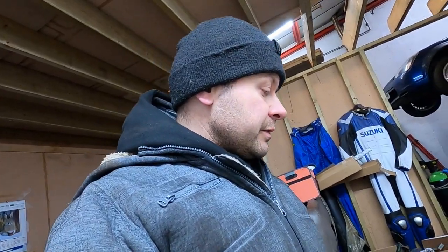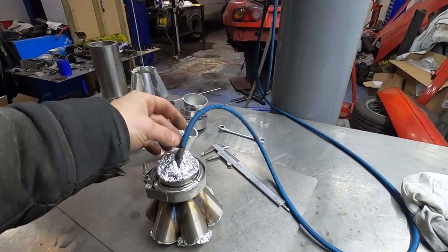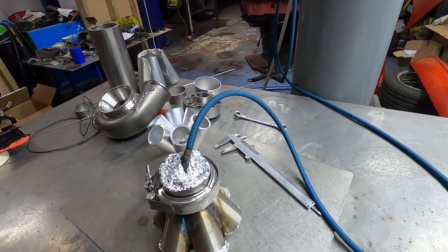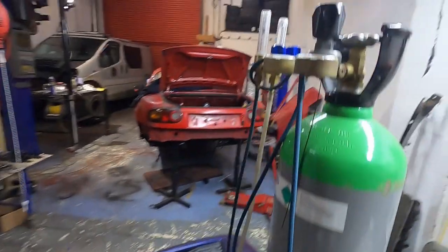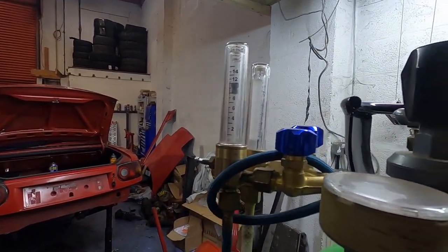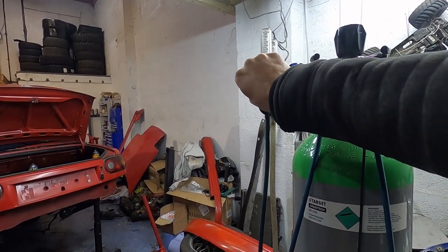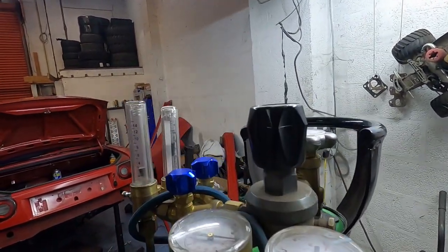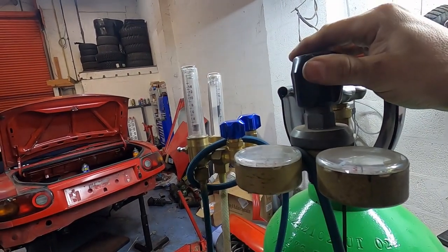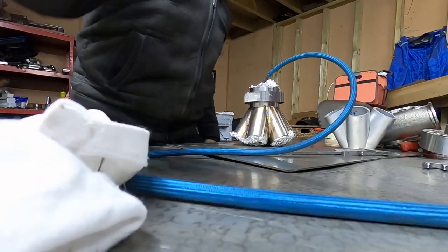So — plug it on, put it in foil, run the gas through and let's weld it up. All blocked. Then you fit a pipe from the top, all kind of almost sealed — obviously not completely sealed because you need the argon flowing in and oxygen going out. I've got about 12 litres per minute right now for the first 30 seconds, then we slow it down to roughly 2-3 litres per minute. On the shielding gas we've got 18 — a bit too much, we don't need it. Let's do it on 17. That will be enough.